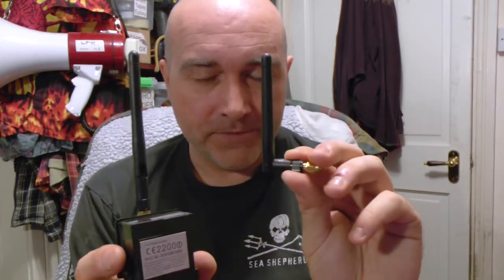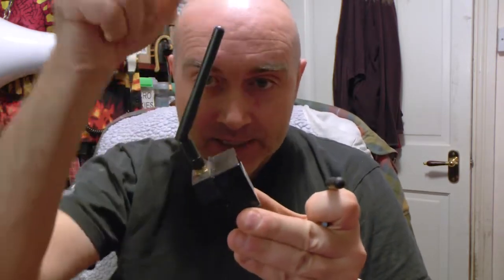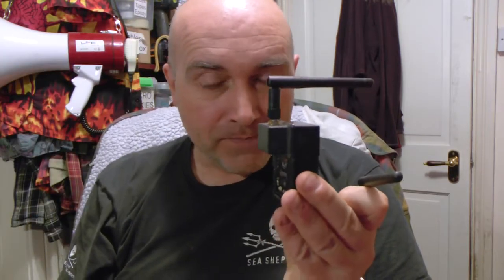And because they're microwave, they're highly polarized, which means that if on your copter you have your little wires hanging out in an up-down direction, then your transmitter also needs to have its antenna like this. And guess what? That's why they put these little things to allow you to do that. And it locks in 2 positions. But that's the reason they have it, because if you were in the wrong position, it would be bad.